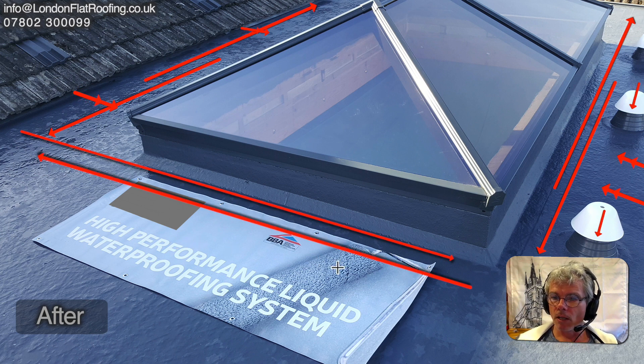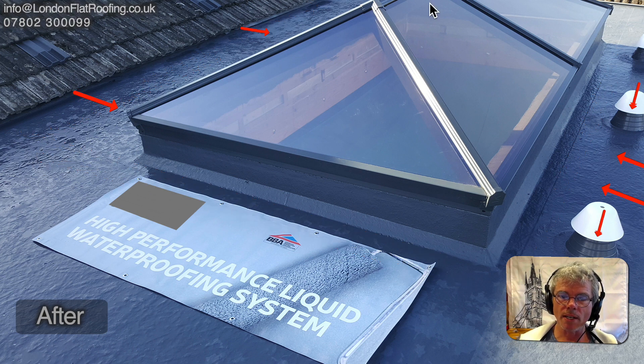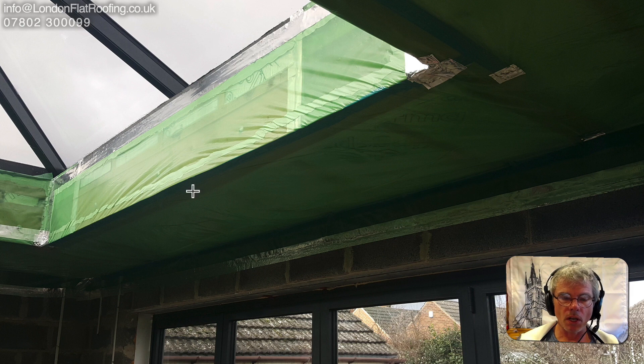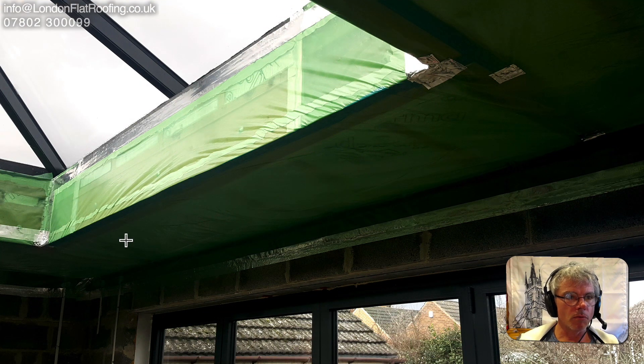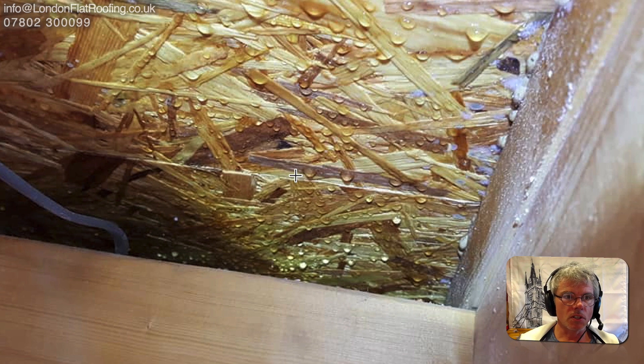He sent me a lovely picture showing the system he used — he's put mushroom vents across the front so now there's air that can come up from the front and flow this way and that way. You've got air flowing all the way up this way, flowing that way, and flowing across at the back. He's got another vent that runs all the way down — this is a really well-vented roof. The key is also that he's stopped moisture from rising up into it and there are no dead spaces.